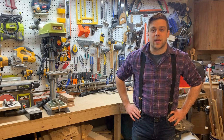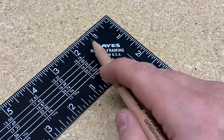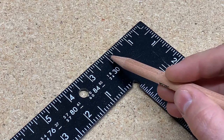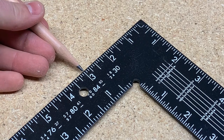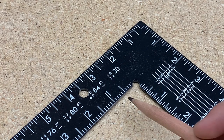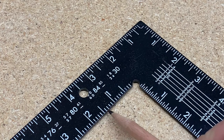Be careful about the measuring scales found on the edges of the framing square. While they look like the normal inches and fractions that we find on our tape measure, some of them aren't. These edges are broken down into sixteenths and eighths like we're used to seeing, but this scale is broken down into twelfths, which is useful if you're reading a drawing at one-foot-to-one-inch scale — so each inch represents a foot, and each small increment represents an inch. And this scale is divided into tenths, which might be useful if you're dealing with measurements in decimal form.